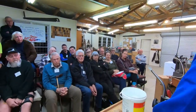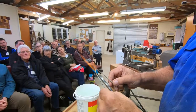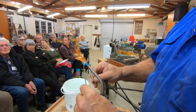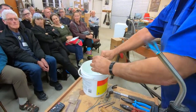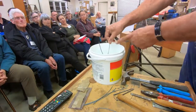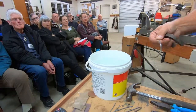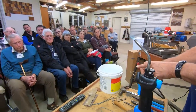I'm now just going to leave that and let it cool down in the air. Now I'm going to quench that. When you quench it you really want to shake it around, because what happens is it goes in red hot and there's a bubble storm on it and then it's not being quenched properly. That's what your file is like.